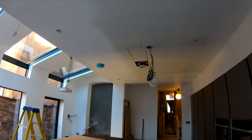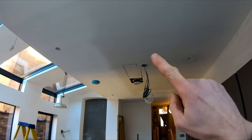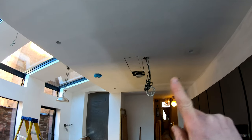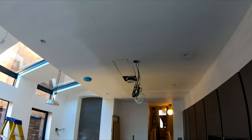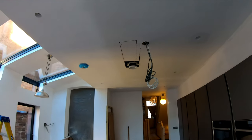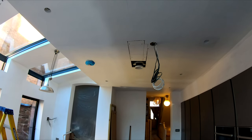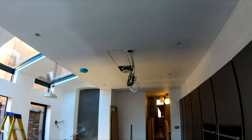I've marked on the ceiling the centre points, so we're going to offer the lightweight frame up, mark around it, and then make some small incisions into the ceiling to ensure there are no pipes in the way. Then we can get decent fixings everywhere, because there's a lot of weight to this — we need to make sure we're very well anchored into the joists above. From the previous project series, we've got some chunky timbers up there supporting the bath, which will work well to hold this up in situ. I'll set up a time lapse so you can watch us do this.